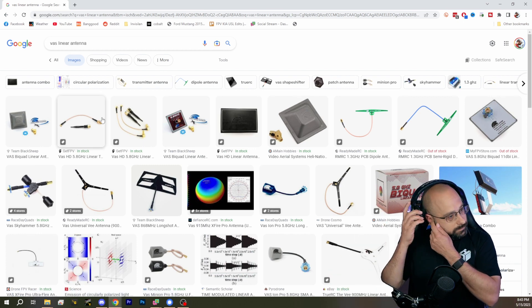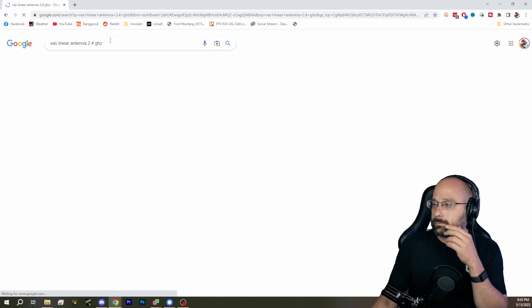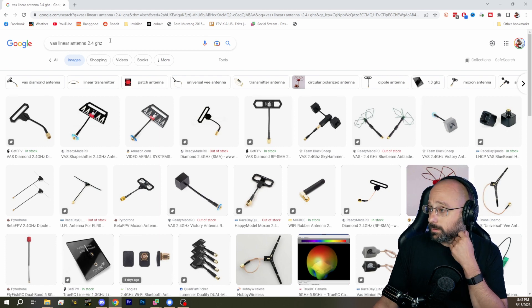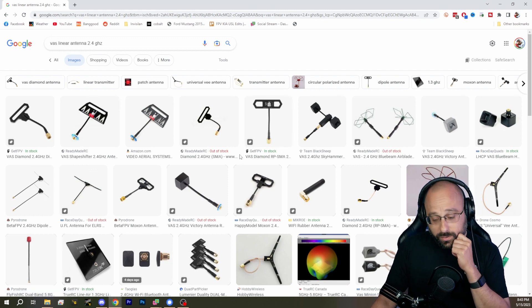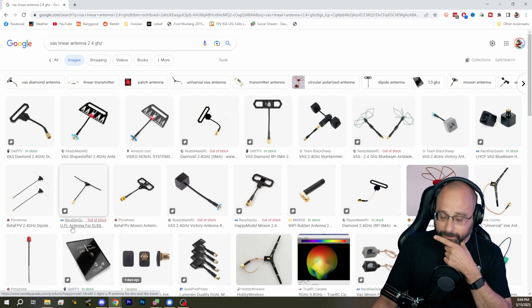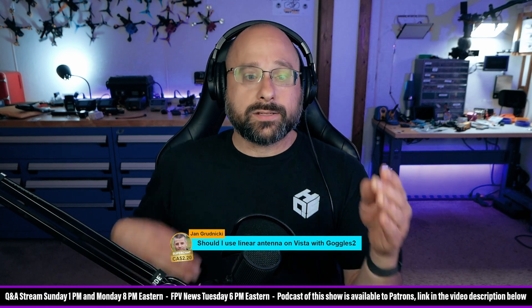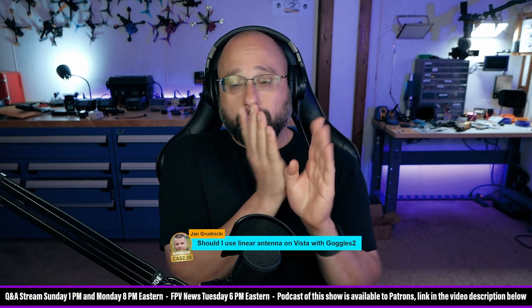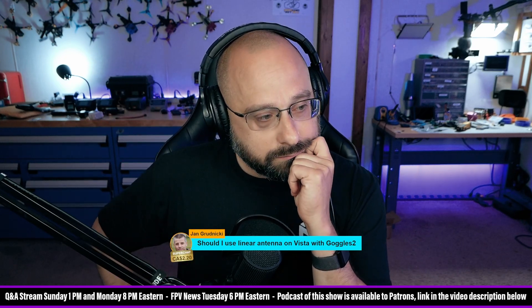I have a question about this idea. So even though the goggles are linear, putting a linear antenna on the drone means that orientation matters with the drone, right? So I'm wondering if you would actually get more benefit out of a linear or if you get more benefit out of something circular, because you won't be flat. That's always been my argument for using circular antennas on drones — your orientation now doesn't matter. The O3 comes with a dual polarized linear antenna, so you've got two elements in there. I think they're at 45 degree polarization, which buys you some flexibility as the quad flips upside down, but the Vista doesn't have that.